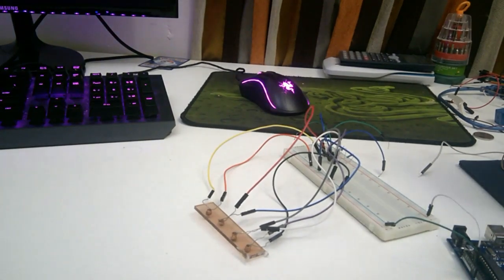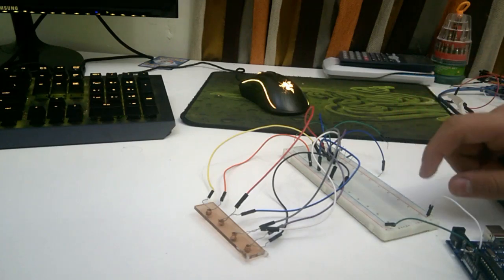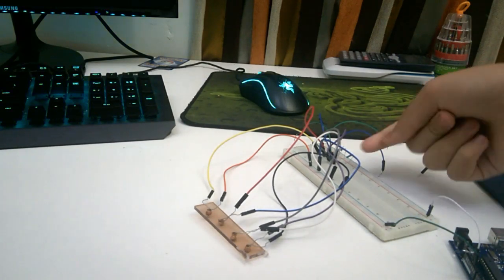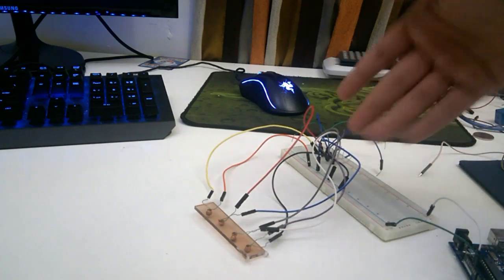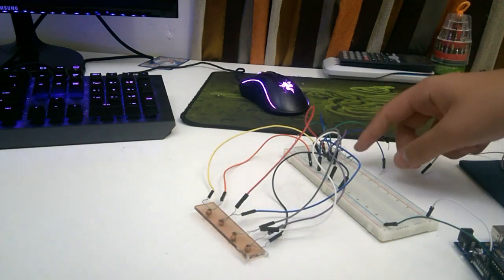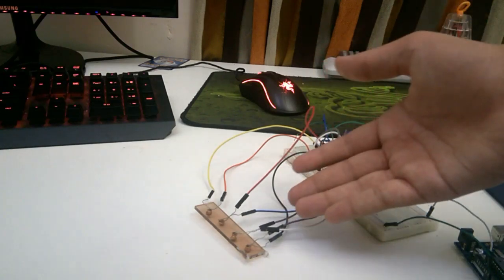We will be powering up our breadboard by using our motherboard, where the GND is going to be connected to the negative, and the positive is going to be connected to the 5 volt. So basically, the 5 volts is going to be connected to the positive side, which is the red line. On the other side of the positive side, we can see that there's a negative, which is connected to the ground pin. The resistors are used to basically not overheat the specific item that is being used, which in this case is the photoresistors.